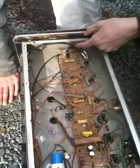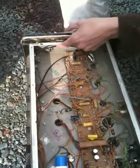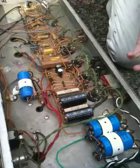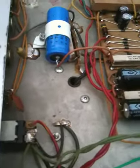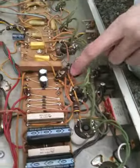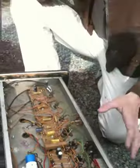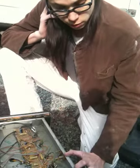These wires weren't shielded. You could grab them and move them around and listen to the hum change. It has a really nasty buzz. The whole amp has this random grounding where it's grounded all over the amplifier. That's just how they used to make stuff like that. It should be on a bus bar and then go to a star ground. And then he put high voltage wires next to signal wires. That's weird as crap. I started to rearrange it, and then I thought, no, I should really try and fix the other stuff. But anyways, I put different tubes in here.